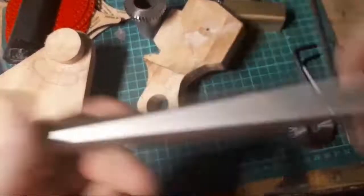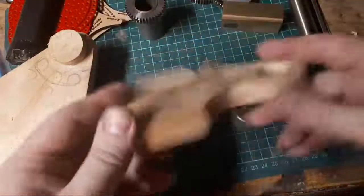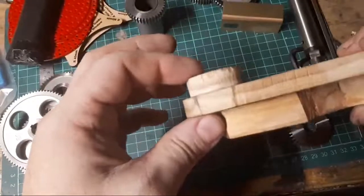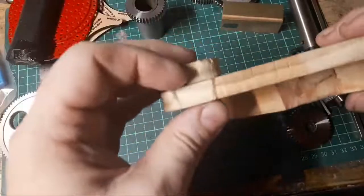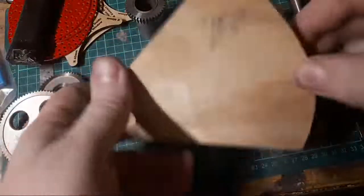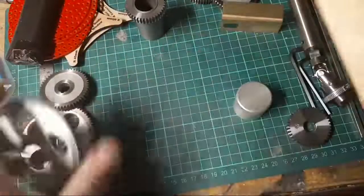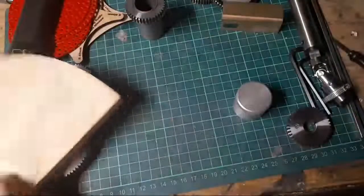So that's coming along pretty nice. I don't know if I've achieved anything this weekend, but we've sort of got some mock-ups. I might go over here and have a bit of a look a bit later on at where all this goes, if anyone's interested. We've only got 19mm between here and here, and 19 here, so 3/4 and 3/4. It's not huge, and they're module 1 gears, so they're not big. We'll have a think about that. I'll probably make something up and see how it looks.